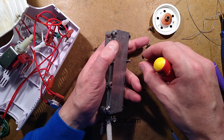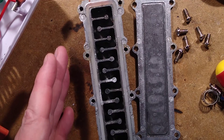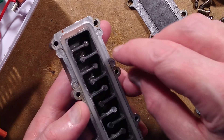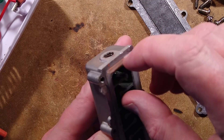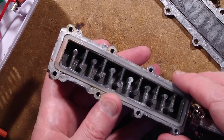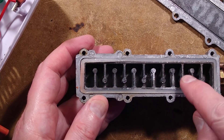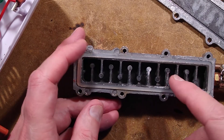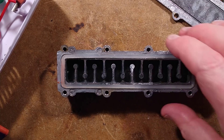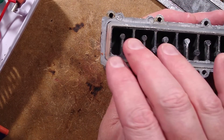What have we got? We have a convoluted path — aluminium casting — with the silicone seal round here. This is very reminiscent of a theatre hazer, in the sense that it's got a very large void going through. If you use this as an ordinary smoke machine, something like this would generally result in a lot of spitting out the front, and I have noticed this machine does tend to spit quite a bit during surges. Because if you tilt the machine up, liquid pools at the back; then when you tilt it down, it starts pouring through and surges out.